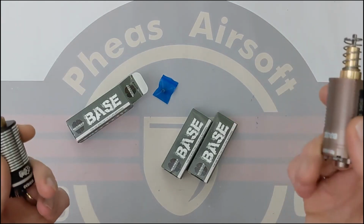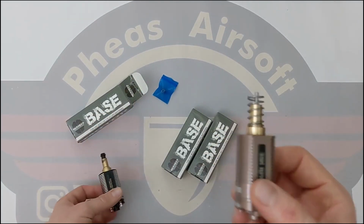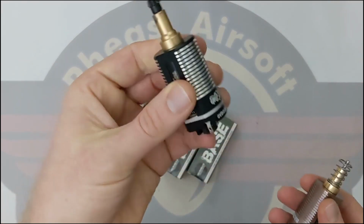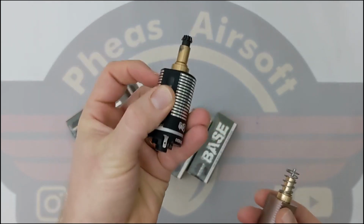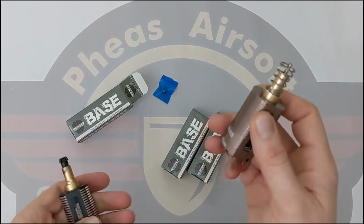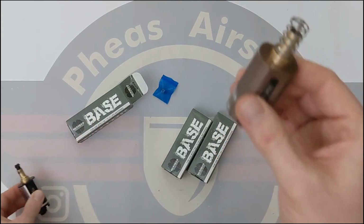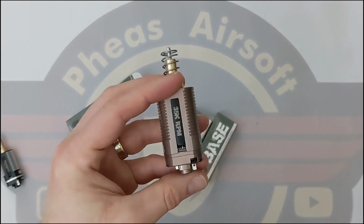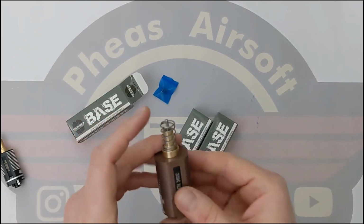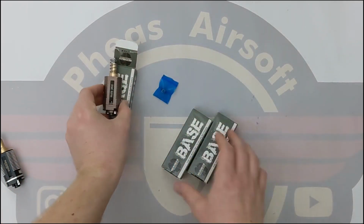They're seeing about 15 to 20% less performance from these motors than the black ones. They've also got the winding, the wire that's wound around the magnets. In the black ones, they are hand wound by precision engineers, highly trained. It's really high cost, basically. On these, they're not as accurate. They are machine wound. And after that, they are absolutely identical. WARHEAD swear by it that even these base models still massively outperform any brushed motor on the market by some margin, which is obviously what we're going to look at. So we've got the 35k model there.